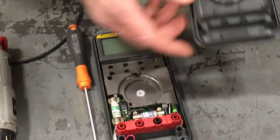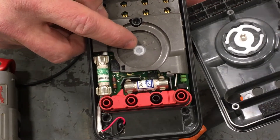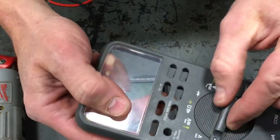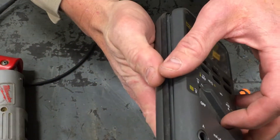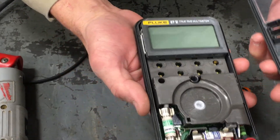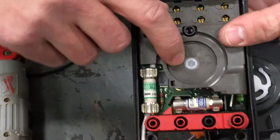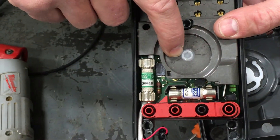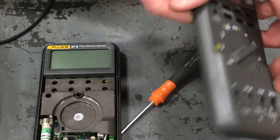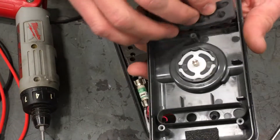Before you put it back together, take note: this is just a basic hex plastic receiver, and it's entirely possible to get it in the wrong orientation — it will mate back up if you do that, but you'd be left with the meter in the wrong selection relative to the legend on the front. Always make sure that plastic pointer is lined up with the line that says 'off', and make sure the selector is also in the off position.